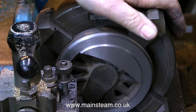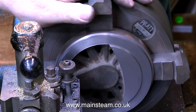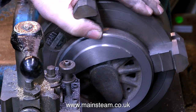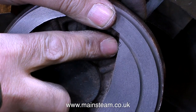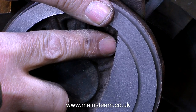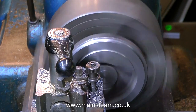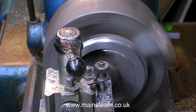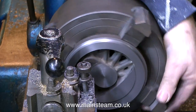I've done this on purpose because this wheel is of no consequence. This balance weight is sticking out a little bit too far and I've left it like that so it's obvious what the problem is. But it doesn't matter how far the balance weight sticks out — if it sticks out a fraction of a millimetre the tool will still hit the balance weight if you attempt to machine the crankweb in one go. It's just impossible, but do not despair — there is a simple solution. You have to be careful, you do need to practice, and you do need a good sense of rhythm for this. And as I'm a musician not an engineer, I do of course have a good sense of rhythm.